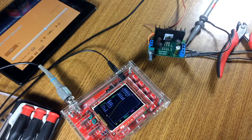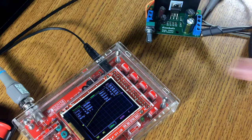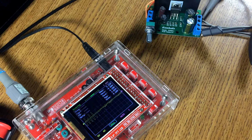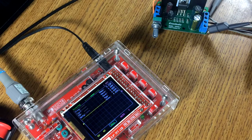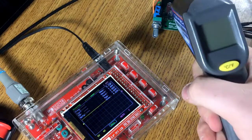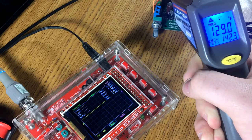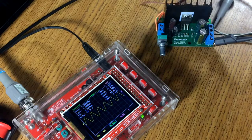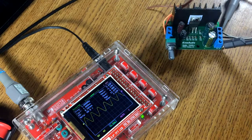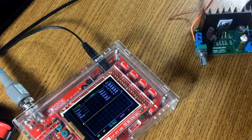Short circuit test in 3, 2, 1. It whines at you. Does that oscillate? Let's go down to 50 microseconds per division and look at that again. I think that oscillates. When it shorts there's actually a whining noise. Wow, that is hot — yeah, that's a little warm for human fingers and I just turned it on. It's obviously oscillating, but I don't know if it's got some kind of a current limit. This may be a real chip — however, wow, that got hot quick, because I just turned it on like a minute ago.